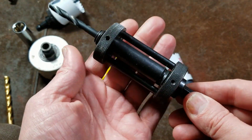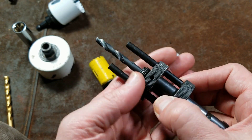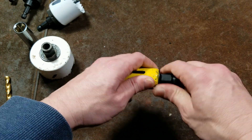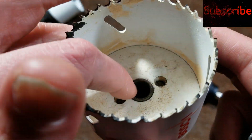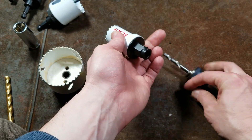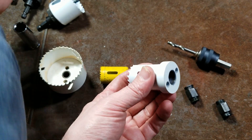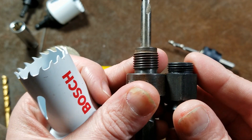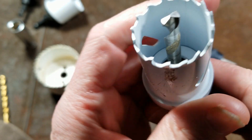They do make adapters like this — same pin drive, but this can also be used to knock out thin cross sections as well as being a handy extension, all integrated into one. One of the other issues with these adapters is that the threads are just pretty shallow. With the standard steel back plate it works pretty well, but if we take a look at even Bosch's own 1-1/4 inch saw with a pretty thick black back plate, we can see the threads just aren't engaging very much at all. Older adapters used to have big, thick, tall threads so that with thick steel bases they would have a heavy-duty engagement going all the way through.